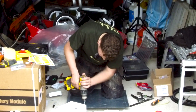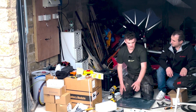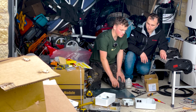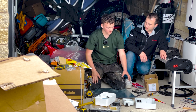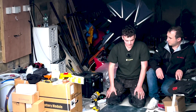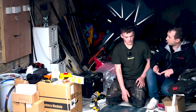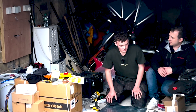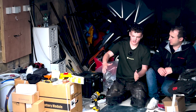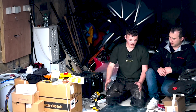Gary, what are you doing here at the moment? We're just creating the plate for all your solar PV accessories — got your isolator, your consumer unit, your comms box for the Enphase, the meter — it's all being mounted outside in a big IP-rated box. It could be mounted in the loft, it could go in your house, under your stairs — ideally near to your meter to keep the cable runs short, though they can be extended.